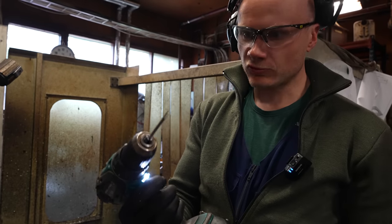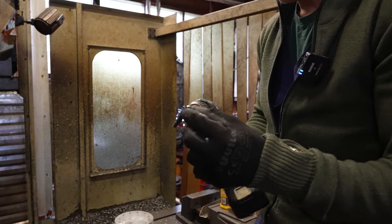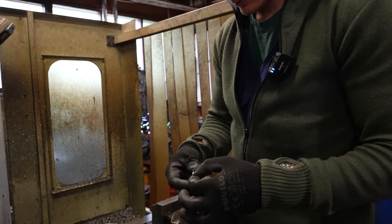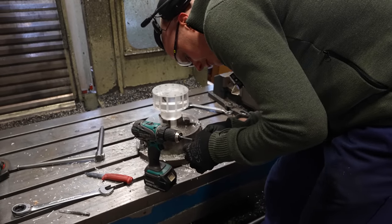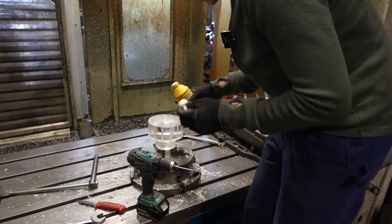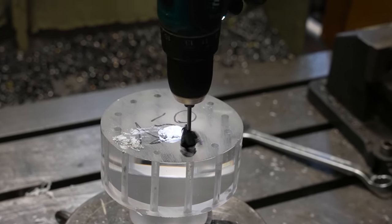And here is my super fancy polishing tool. A steel rod with a grinder cut in the middle. And then we take some sock material. This is not a used sock. It's a brand new sock that we sacrificed for the entertainment. In the name of science. Then some polishing sheet. Spread the sheet on the sock. And then push the sock into the hole.